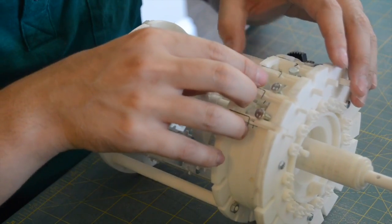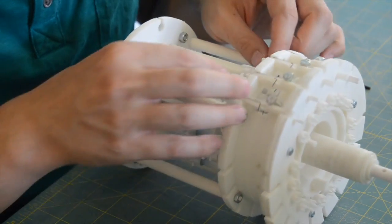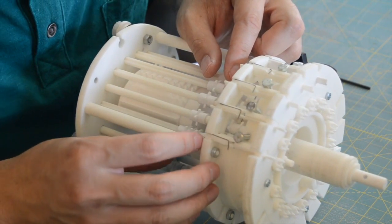Align the turns counter transmission gears just above the step drum. The gears should be lined up with each other pretty closely. The first shaft has 3 gears. Align the middle gear with the rest.